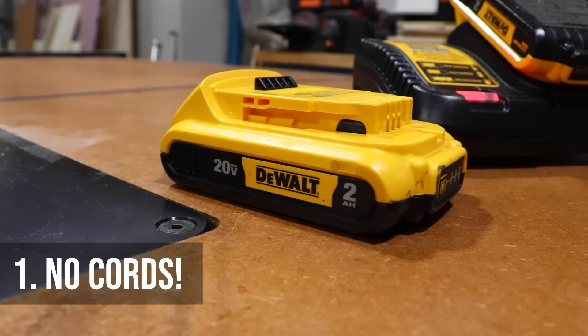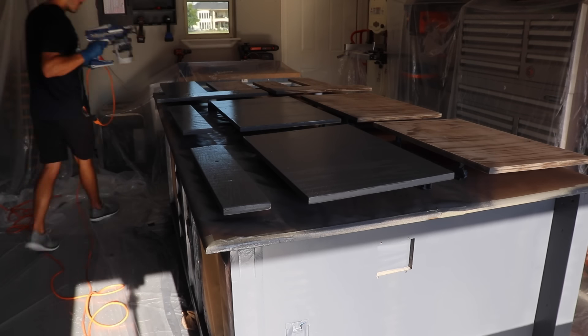The first thing I really like about the sprayer is the battery. It's cordless, of course — but hear me out. The obvious benefit of a cord is that you'd never run out of battery, but with these sprayers you're never really doing a job where the battery should run out. In fact, this battery has lasted me several jobs. The bigger problem with a cord is that it tends to drag through wet paint — and chances are you're going to get paint on something you don't intend to. That's where the cordless design really comes in handy.